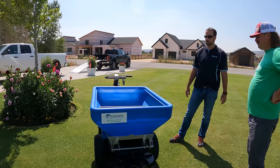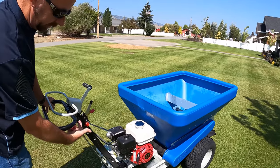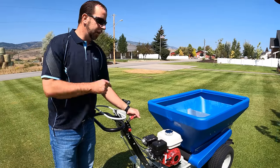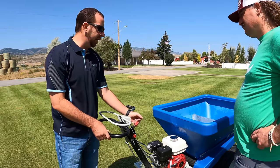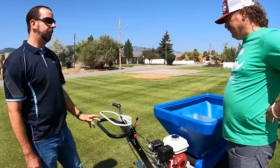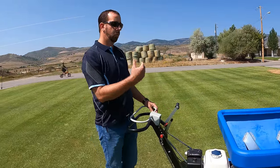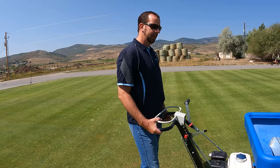This will hold a third of a yard. You can dump it in with a skid steer or shovel — they just want you to feather it in so it's not one heavy clump. All your controls are up here. You turn it to the on position, choke it, and pull start it. The lever engages your belt and auger. When transporting, you just pull it down to drive wherever you need to go, then engage the auger and open the door when you're ready to spread.